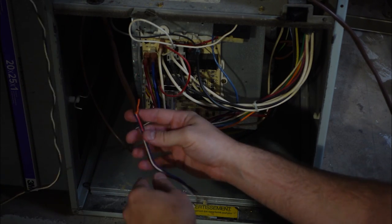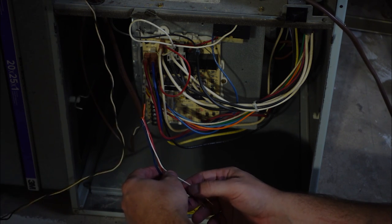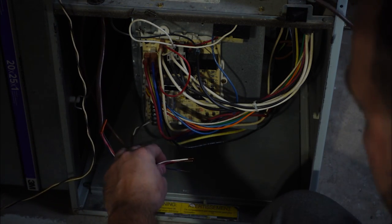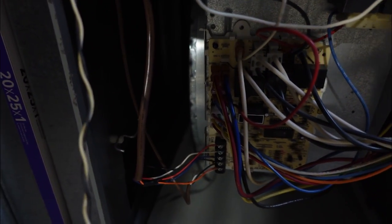I have my four wires here. It really doesn't matter which color wire you connect — just make sure you have them marked. The Ecobee does come with little labels you can stick on the ends so we know which color we're connecting, because you're going to have to match it up on your Ecobee. I did make one mistake: you actually also have to have a ground wire because we're connecting the 24 volts, so make sure you connect your ground wire. You should have five wires if you have your air cooling and fan set up, or four if you choose not to connect that — but it's great to have all five from the beginning.